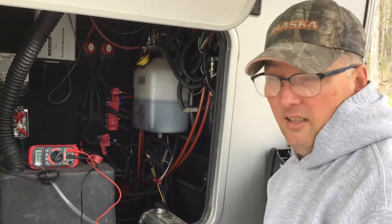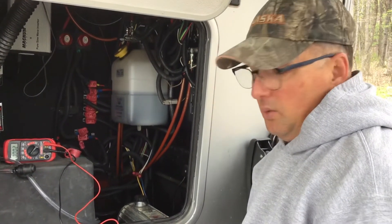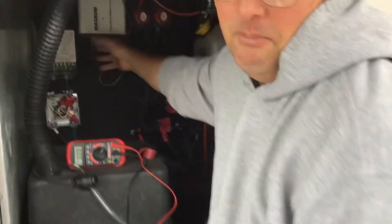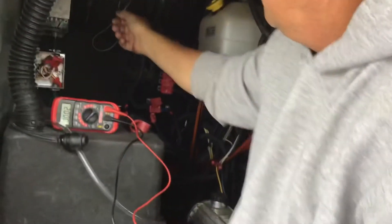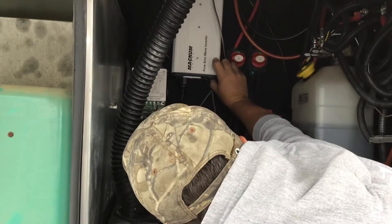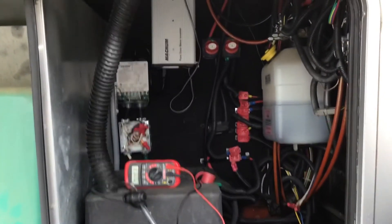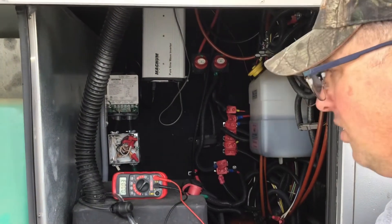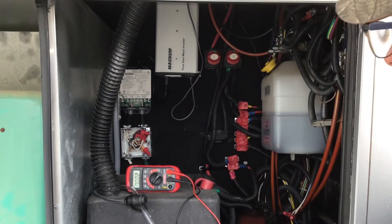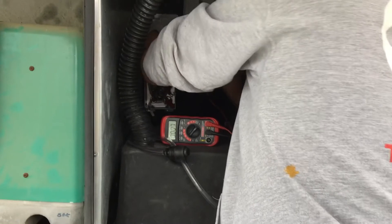I finally got all the lines tightened back up. The transfer switch is loosely installed and the access cover is open. I'm going to turn the batteries on here and then reach in and turn my inverter on — that's the beeping sound you heard. Now if I did this right, on the AC output load side I should be able to get 120 volts on the meter. Julie can try and keep an eye on the meter while I get the probes in there.